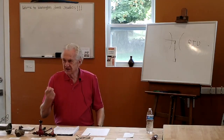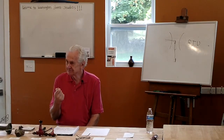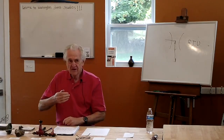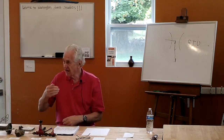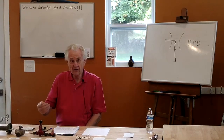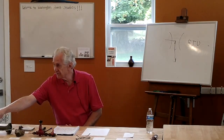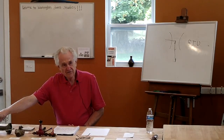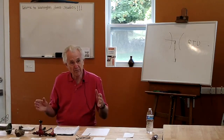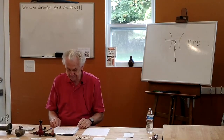Or it's about the total heat you get when you strike a wooden kitchen match. That's about one BTU. Since you're firing over time, it's BTUs per hour. Even though the shorthand is that people say it's a so-many-BTU burner, what they mean is BTUs per hour. So typical burners might be anywhere from 50,000 BTUs to this one, a 500,000 BTU burner. So this burner will put out 500,000 BTUs per hour, and they go on up from there. But typical pottery burners are roughly in that range, 50,000 to 500,000 BTUs per hour.